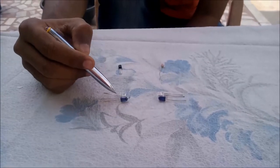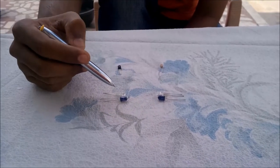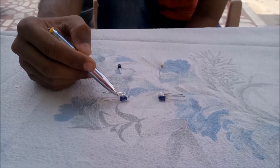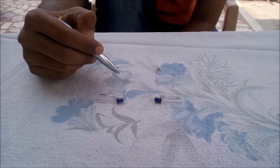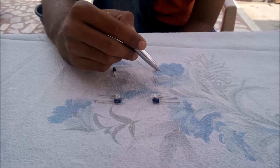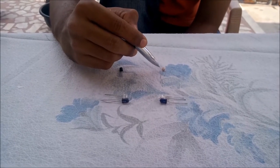These are 2 pairs of IR transmitter and receiver which we shall be using as an obstacle detector. The receiver gives us analog values which, when they cross a threshold value, indicate an obstacle hitting the robot's body. This is an LM35 temperature sensor which will provide us the temperature of the water body. This is a light dependent resistor which, when exposed to light, varies its resistance and provides the intensity changes in the water body.